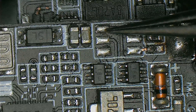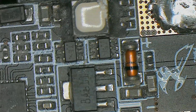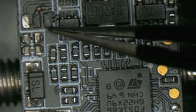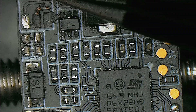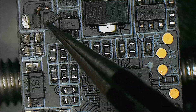So this is the one. Here one LED has to be in place but it appears somebody took it out. If we look at the Betaflight one, you can see they installed an LED here and also used some sort of epoxy to hold it in place. But on this one no epoxy was used, so in a crash or prop strike the LED ripped off from the PCB, taking with it the pads — this one, this one, and this one.